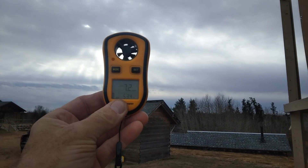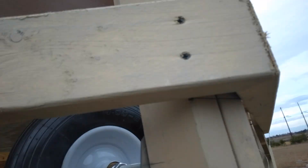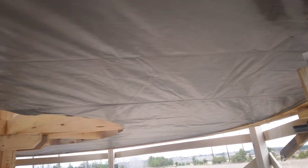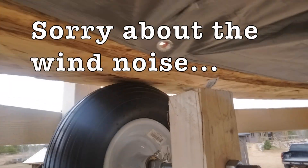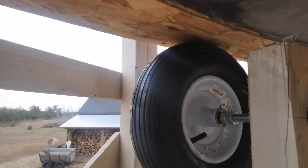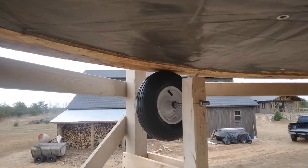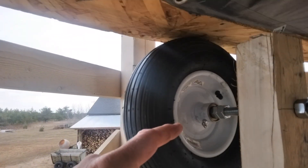The wind speed is between 5 and 10 miles an hour again. I started putting some wheels underneath the turbine — I'm going to have two that are just idler wheels and then one for power. I'm having a little bit of difficulty with that unbalanced wheel. It's showing a quarter-inch difference — you can hear it on the wheel; it binds up a little bit and then opens again. I think I'm going to have to do something to try to balance it out, and I might have to get a smaller wheel too.